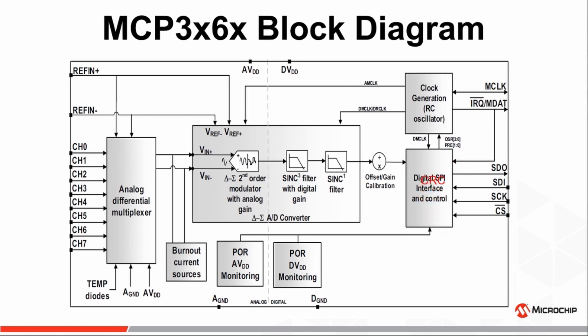A 16-bit SPI communication CRC is also available for securing read operations and maintaining data integrity against EMI interference or large transient spikes.